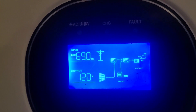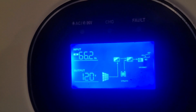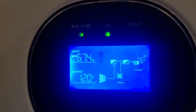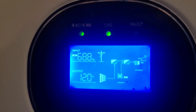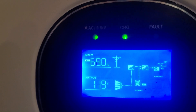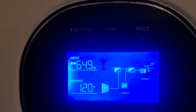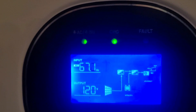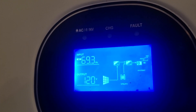I figured out that the problem is when you power up your generator — and it's adequately sized, I have a 9,000 watt generator — the issue is really to do with power loads. When you fire your generator up, they're kind of geared to have that surge, so your hertz run a little bit higher and it won't actually engage because it's not synchronized. Don't take all this to heart — call an electrician if you're not sure of anything, because I am not a licensed electrician.